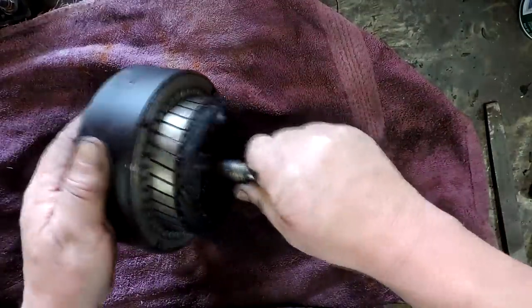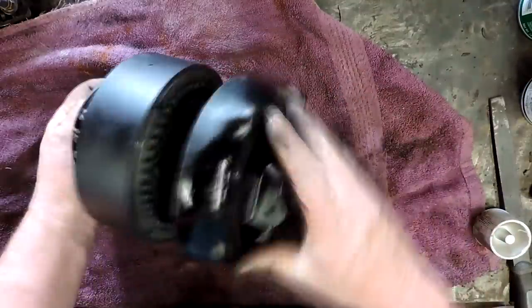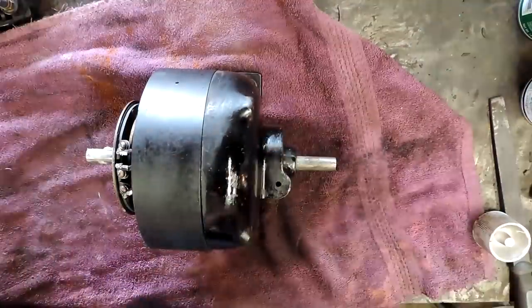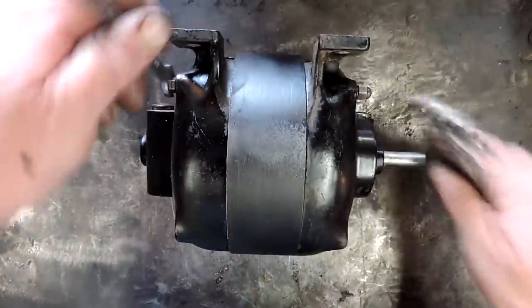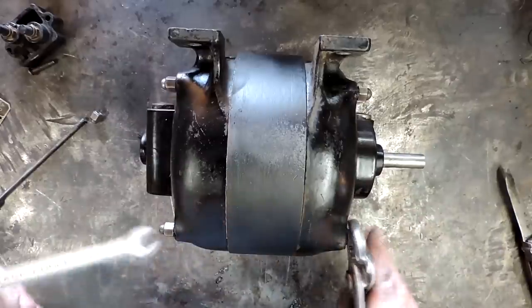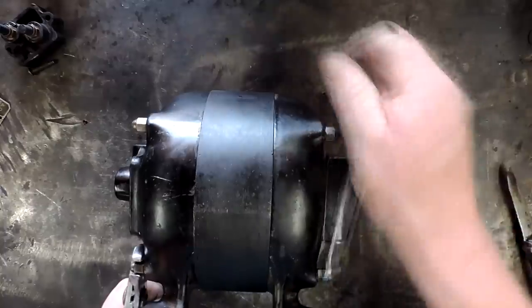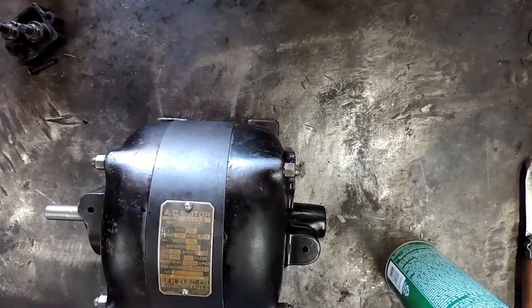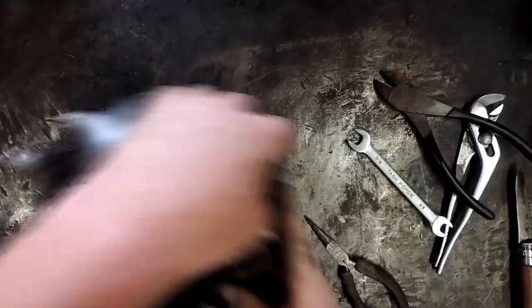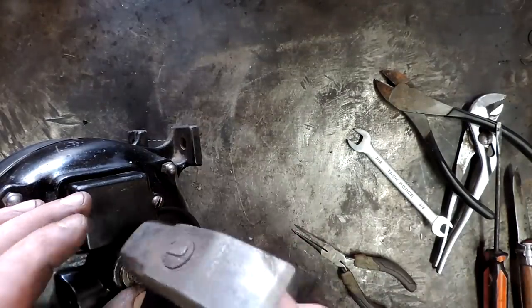This is another yard sale find — I have a lot of yard sale and estate sale finds, and when I see something interesting I'll pick it up and store it. Eventually I'll find a use for it, and that was the case with this motor. I've had it for probably a couple of years and it just happened to be the motor that was used on these early drills. These drills have a number of names — post drills, pillar drills, self-advancing drills. I think the catalog just calls them a drill. The motor has fibrous sponges at either end that hold the oil for the bearings, and they were in really good shape. We've got our little brass rivets back in there to get the identification plate back in place, and we just put an extension cord on it. The cord that came off was simply two wires — no ground wire — and that's what I put back on it, though I may add a ground lead eventually.